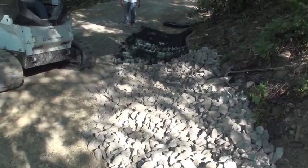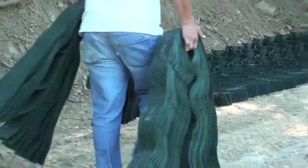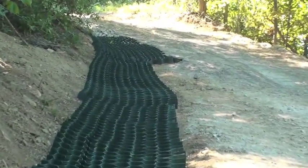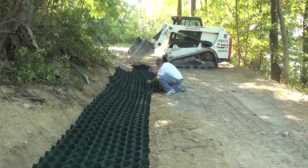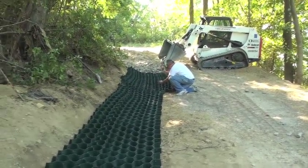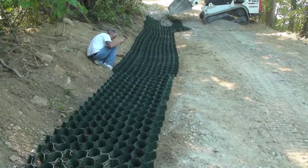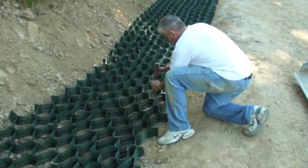Before you infill your slope grid you need to attach it to the hill. We are going to use J hooks. Lay out the rest of your material, connect the pieces together, and expand it completely down the swale. You must connect each piece, then you are ready to install the J hooks. If it is too rocky to install them by hand you may need to use a Hilti drill. A large hammer drill may increase your productivity. You need to put a J hook every three feet down the side and one in the center every four to six feet.